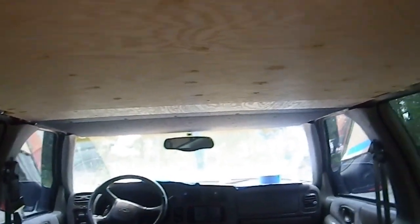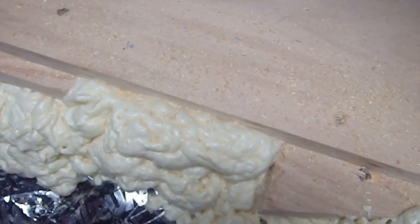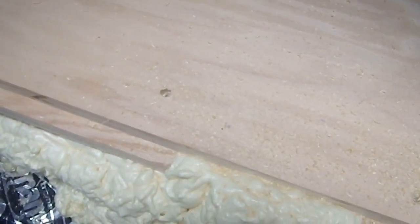There's oak with spray foam everywhere down here. What we do is we attach strips that fit over some sort of mounting hardware back here, then screw the strips down so we're able to screw the wood to the strip. Same thing happened on the lower deck — found some strips, anchored them down, and then we were able to go on to the wood and just directly start screwing.